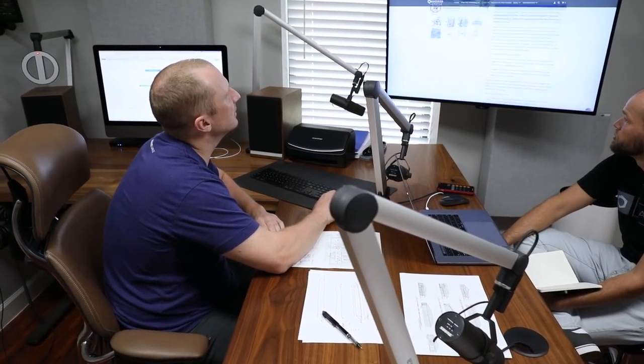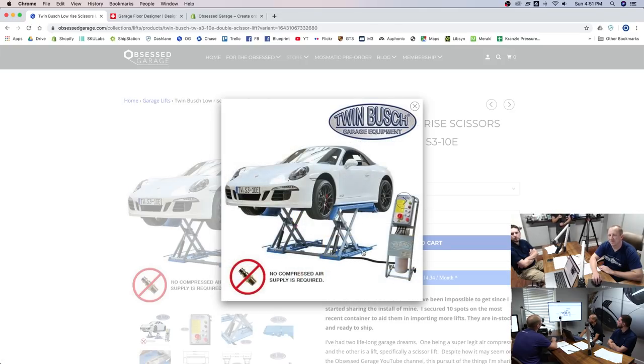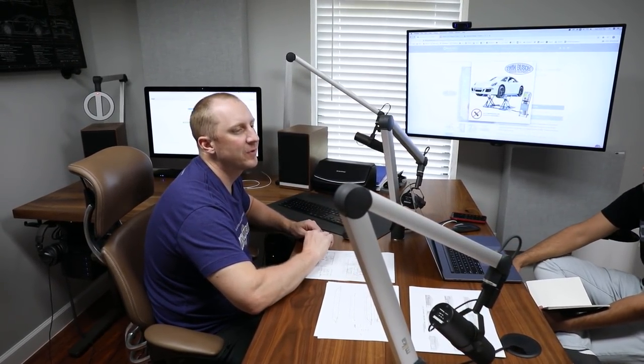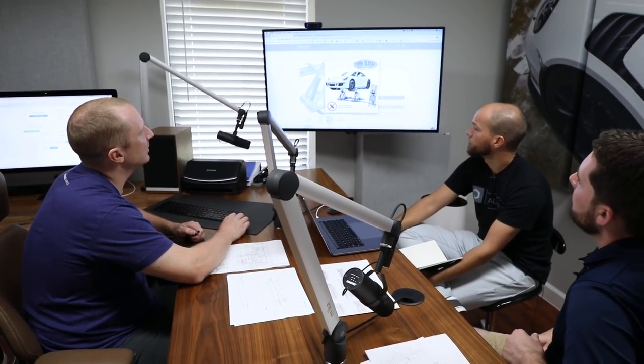So you've got another 20 inches of delta — that's worth it. Get the full-rise. The difference in price is $2,500 versus $3,800 — so $1,300 difference. We just set the limit switch on your full-rise at whatever your maximum height is for the tallest car and it won't go above that. The only advantage of the mid-rise is no compressed air needed, but you're going to do that anyway.